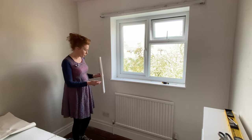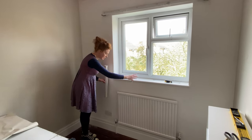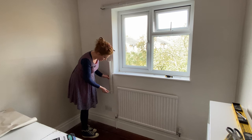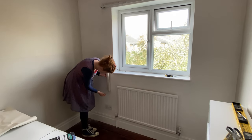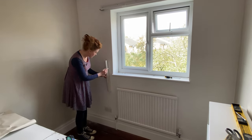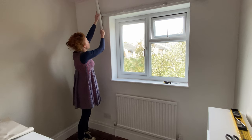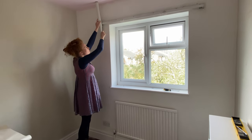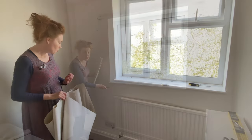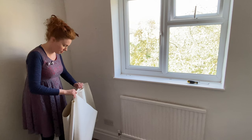We've taken the pelmet down and we're working out where to put our pieces of horizontal paper. The best way to tackle this is to get one piece that takes in the width here and comes to about the height of the brackets behind the radiator. Starting this piece of wallpaper here, I'm going to have one piece taking in the socket, another below, and then a whole piece taking the top of the window in. I've drawn my line on the wall — it's also going to cover this crack, so that's good.